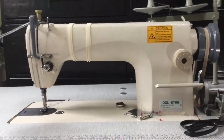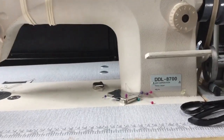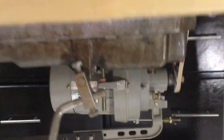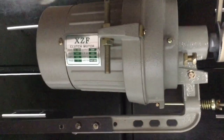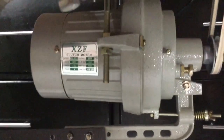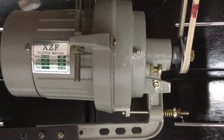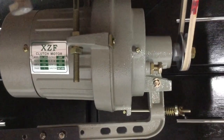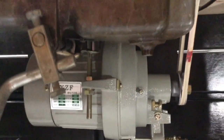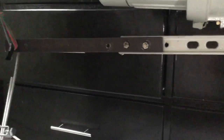This industrial straight thread sewing machine, the Juki DDL-8700, is driven by a clutch motor — 250 watts, 60 Hertz, 220 volts — and it turns around 3500 RPM. The pulley is almost a one-to-one ratio, or maybe one-to-two ratio, so it's still quite fast. Since I've already done the modifications, I will sort of reverse engineer how we did it.